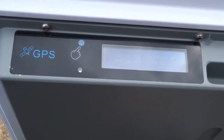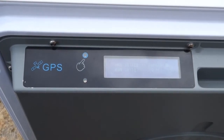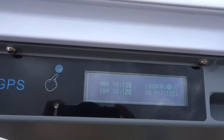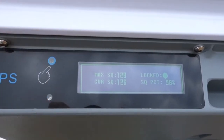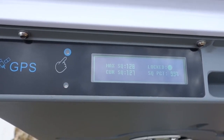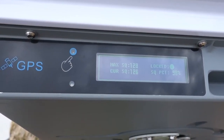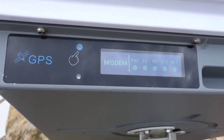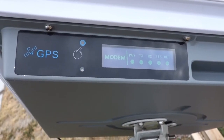From here you want to go in and do the fine point, maximizing the signal to optimize for the best signal quality. I've now done all the fine adjustments to peak the signal. You'll see I've got a max of 128 and a current signal percentage jumping between 98, 99, and 100. The max hold is a good reference point for what was your max signal quality during the pointing procedure — you want to try to get the current to match or get as close to that as you can when you lock everything down.